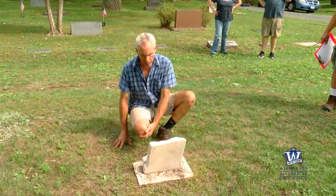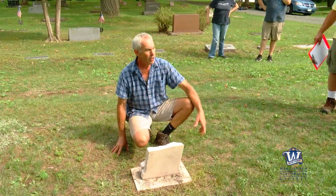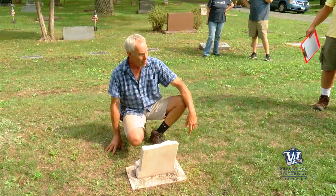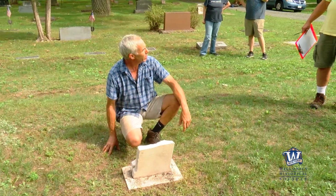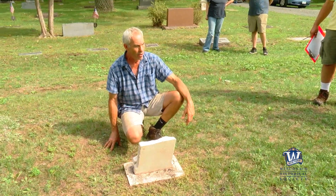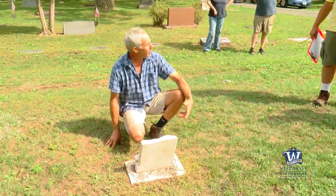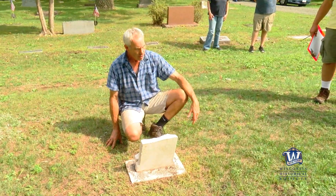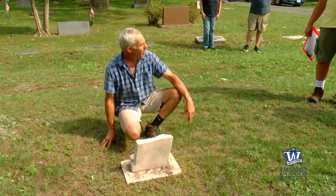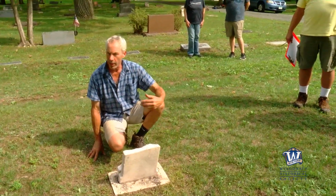The overall principle with historic pointing mortar really comes from architecture. Say a historic brick structure that was built before 1900 is going to have soft, handmade bricks. So the main thing we want is a mortar that's similar in hardness and more breathable than a modern mortar. We're looking for compatibility, and you should think of a historic pointing mortar in a structure as something more sacrificial. The first thing that should fail would be the mortar, and then you could scrape it away and repoint it.